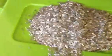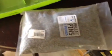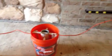that's 5 pounds of stainless steel pins. We use these pins to clean the brass, of course. And there's another 5 pounds that I bought because I'm cleaning a lot of brass, and these pins I don't think were quite enough by themselves. So anyway, we put the pins, and I've got about 2 gallons of water here in this bucket that I'll put in there. And then we put in a product called Lemi Shine. Where'd I put my Lemi Shine? There's the Lemi Shine. This, of course, goes inside your dishwashers to clean all of the deposits that form inside your dishwasher. So anyway, use a little bit of Lemi Shine and a couple of drops of Dawn dishwashing liquid.